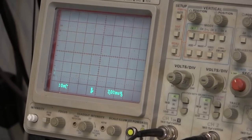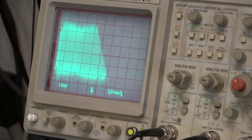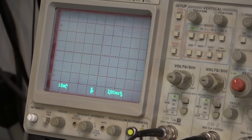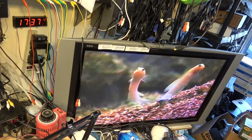So as you can see, this is an SP tape. Now, it was recorded on my machine, a Super VHS tape years and years ago. But as you can see, the alignment is not quite right, so I'm just going to tweak it slightly, and then I'll check with my reference tape. So the alignment now is pretty much flat. Check the other side, the other guide. Wasn't off by much, just maybe a quarter of a turn to bring that back up. And there's that recording. Looking excellent and sounding good too.